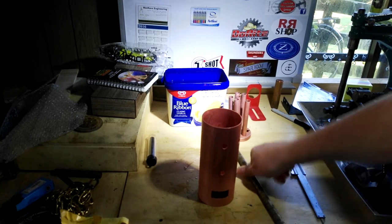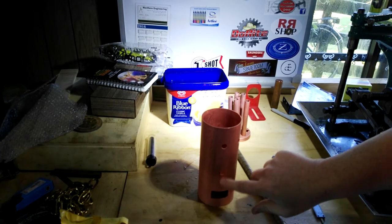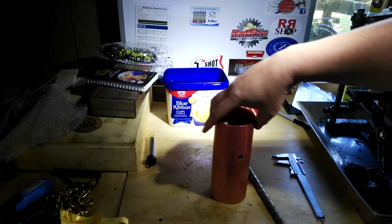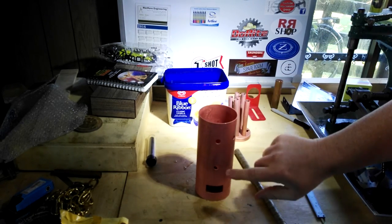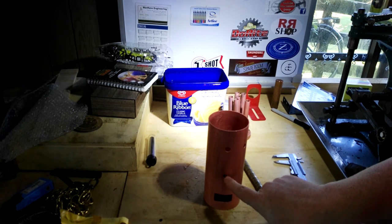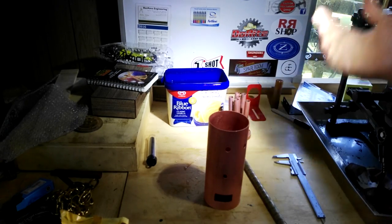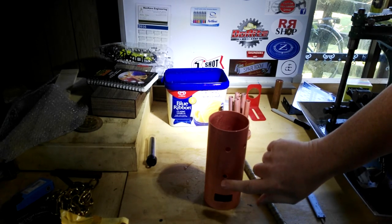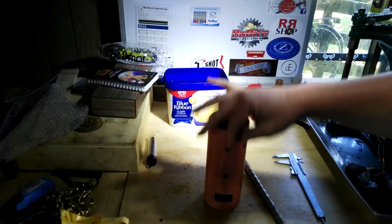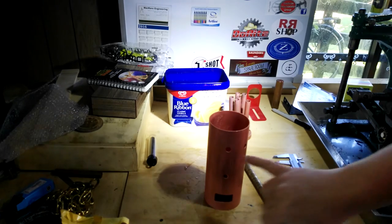The bushes are pretty straightforward. I'm going to make two today which are the water gauge bushes, probably one which is a little bit smaller, and one the same - so three total: one for here, one for here, and one for here. These are going to need a jig and some screws to hold it together. I'm going to hold this in place with a couple of screws on a jig so they actually line up, and the tube for the gauge glass just drops down through. That's the idea.